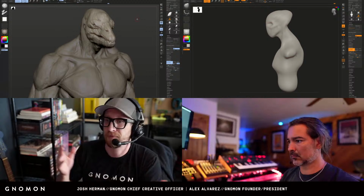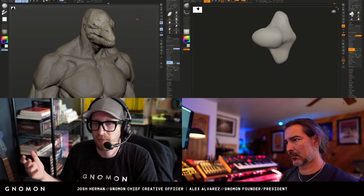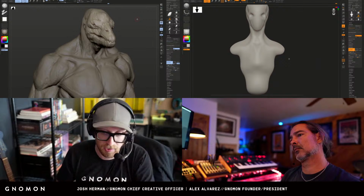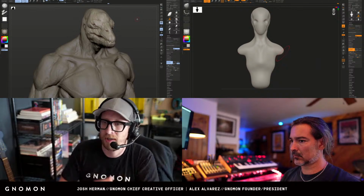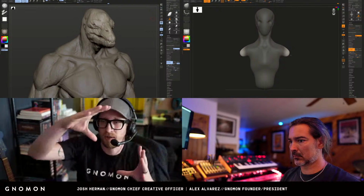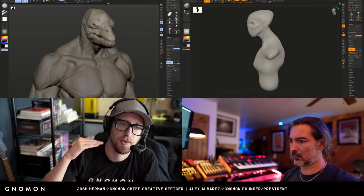So if it's bigger, meaning the footprint of it is bigger, it doesn't matter if it's 6 polygons, 8 polygons, 1,000 polygons, or 20 million polygons, because it's just printing a single layer at a time. The way that I had it explained to me, which I really like quite a bit, is think of it like ink on a paper, on a traditional inkjet or traditional paper printer. What the printer does is it analyzes your model top to bottom, and you orient which way you're going to lay it down on the printer, and it's going to slice it into thousands of slices. So it basically does each individual layer.